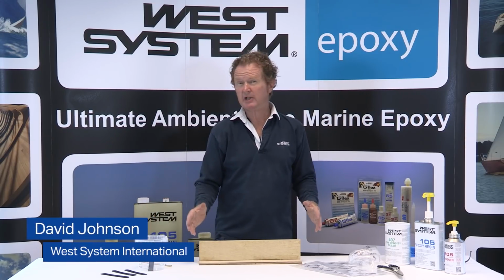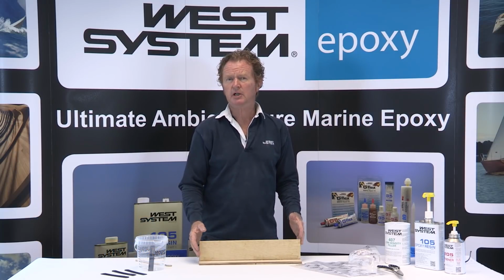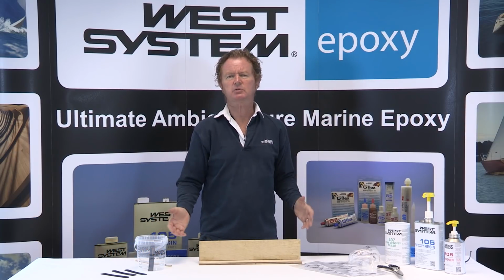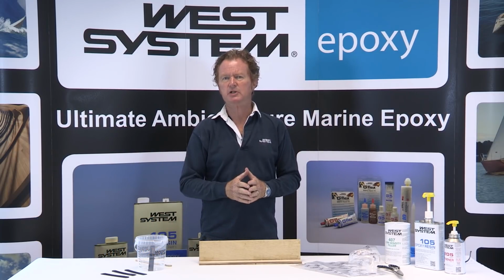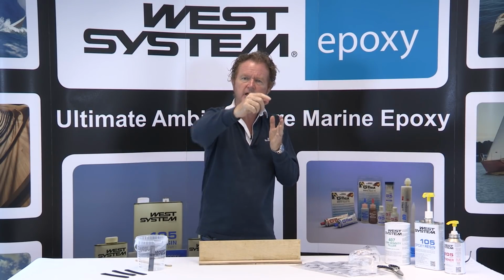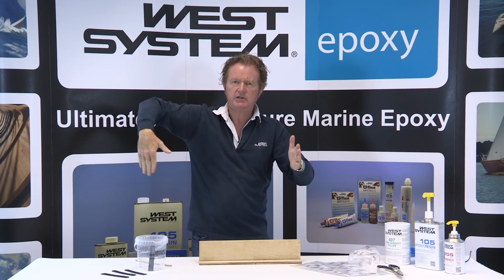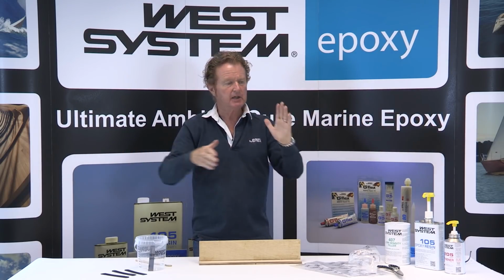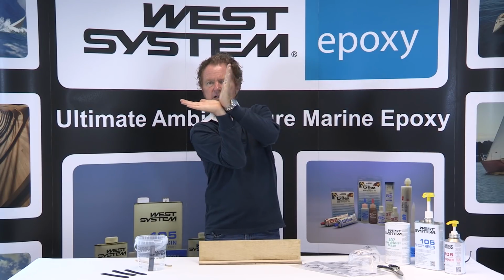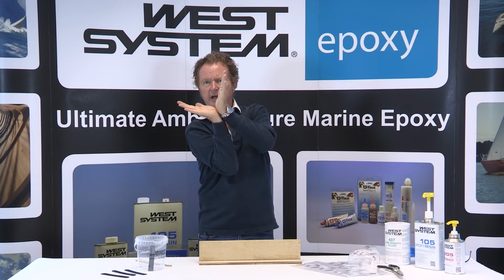Bonding with fillets is a fantastic method of building in plywood. It's almost fundamental to any type of plywood design that's out there, particularly lap strake boats where a fillet bonds another panel to another panel and then bulkheads to the skin of the hull. And it's done by creating a cove in between two joining panels.